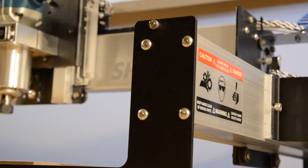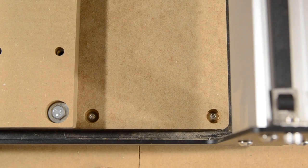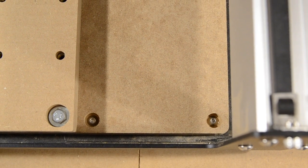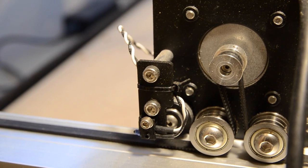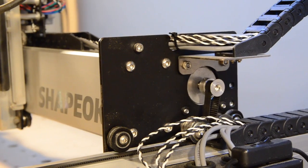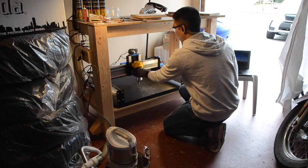2. Bolted connections rely on through-holes. Through-holes are typically oversized. Oversized holes result in slop, and slop is bad. Slop can lead to parallelogramming of your base, tilting of your spindle mount, divergence of your rails, and so much more. These two sources of error are what I'll be addressing today, but you don't have to stop here in your pursuit of perfection.